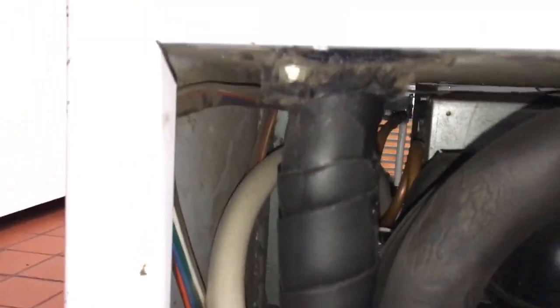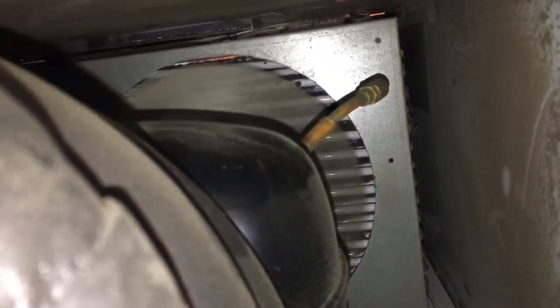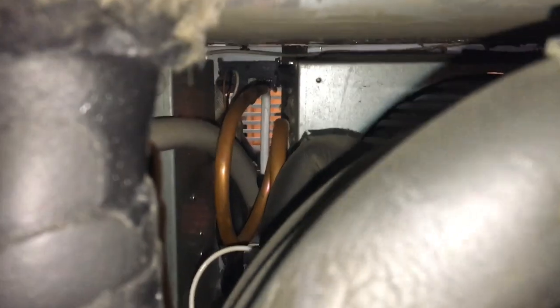These cases are known to spring a leak inside the walls. I don't think it's that old - somewhere between five to ten years. I can see if I didn't get my hands on the hot gas line. I think it might be the hot gas. Woo! Yeah, toasty - that hot gas line is freaking hot. We definitely have refrigerant, definitely doing work.